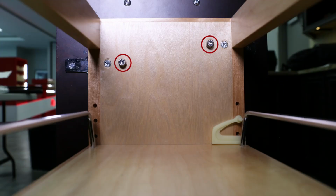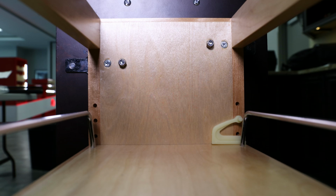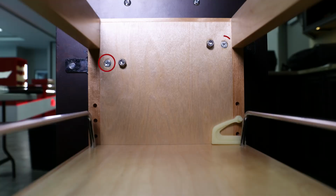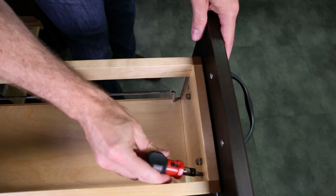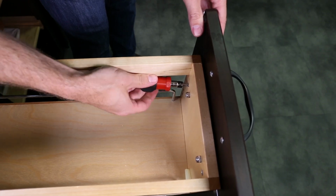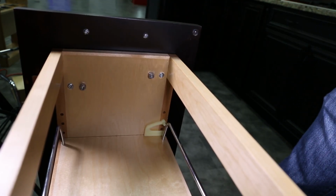Precisely adjust the door skew by sliding the adjustable mounting brackets left or right as needed. Tilt can be adjusted by using the 8mm nuts and turning the T-nut screws so that it pushes against the metal bracket. Each corner is able to be adjusted independently. After adjustments, we recommend using the door bumpers on each corner.